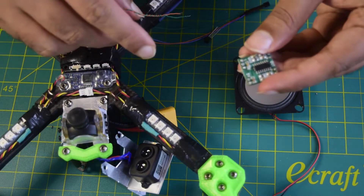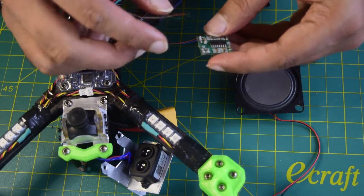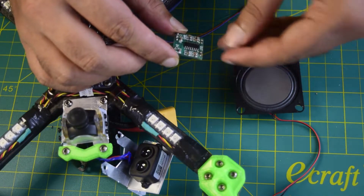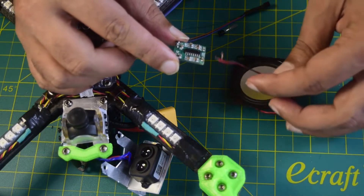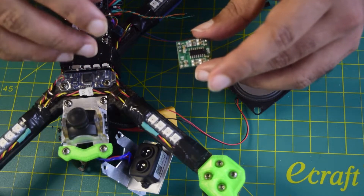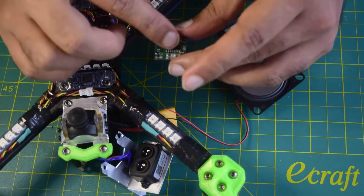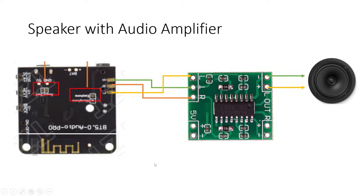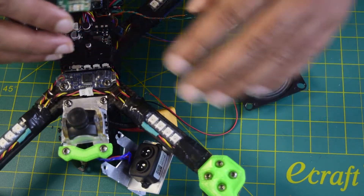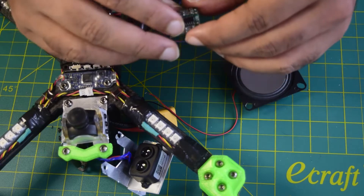This amplifier will be connected onto my speaker. Audio input will come from the two wires, and I will have a 5V supply which I will be turning on and off using a transistor. Output from one of the channels on this chip will connect to the speaker so I can play audio. The audio will be transmitted from the bluetooth module, amplified using this chip, and then output to the speaker via the audio amplifier output.